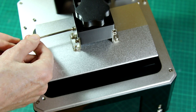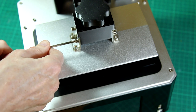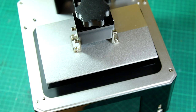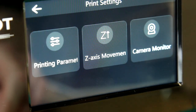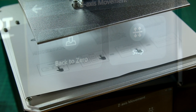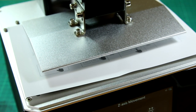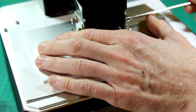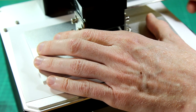Before you use a resin 3D printer you need to level the build plate, and it's something you'll need to do on a fairly regular basis. To start, undo the screws on the side of the build plate, then go to print settings, Z-axis, and choose leveling. Insert a sheet of paper above the LCD screen and below the build plate. The build plate will come down and stop when it hits its minimum value. Holding firmly on the build plate, do up those screws again — that gives you a nice level build plate parallel with the LCD screen.